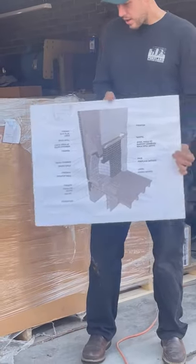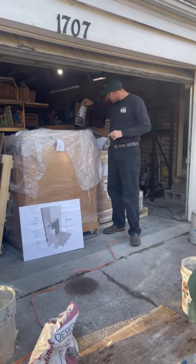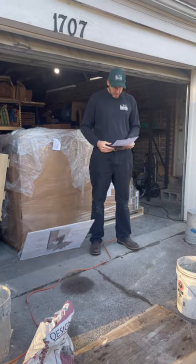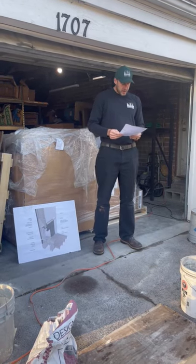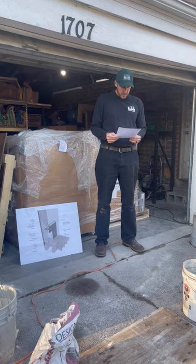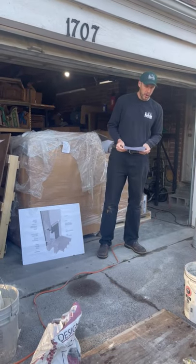On your handout, at the bottom, it says NFPA, National Fire Protection Association, 211, standard for fireplaces, chimneys, vents, and solid fuel burning appliances. Code reference 11.2.1.13: inner surfaces of the smoke chamber shall be parge coated smooth with an insulating refractory mortar.